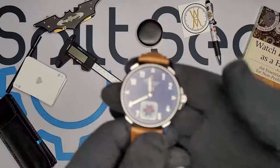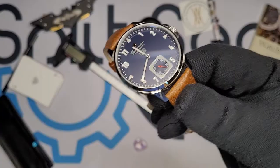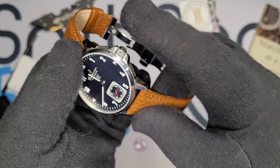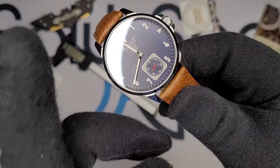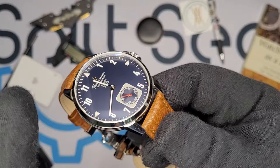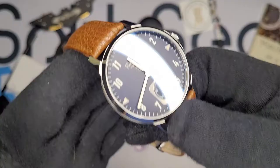The one I have in my hands is a prototype, so there are a couple of changes that are going to be made. First, the crown is going to be enlarged a little bit — that's something Adam has brought to my attention. Also, this prototype has a movement that is not the final one. It currently has the ST36 hand-wind; the final version is going to have the SW260 Selita movement, which is automatic. Keep in mind that when I measure the thickness, the production model is probably going to be slightly thicker because of that rotor. Other than that, what we have here is pretty representative of the final product.